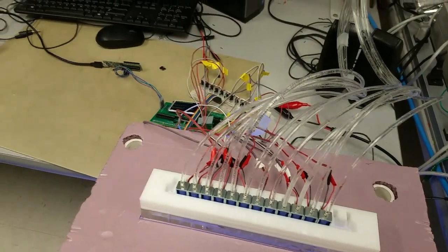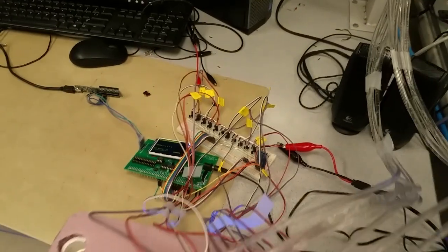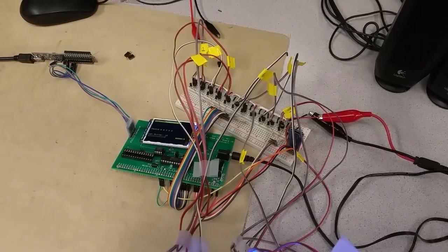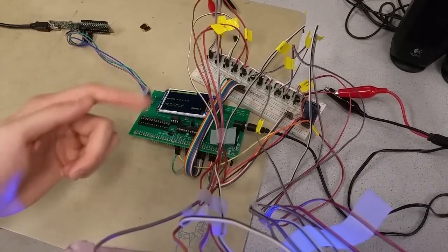So now let me talk about the app part. After the app is turned on, it takes five seconds for the computer to establish a Bluetooth connection with the HC06 Bluetooth module in the PIC32. There's a Bluetooth module right here. The rest of that board contains the solenoid drivers — the transistors, solenoid, and diode protection circuits — all connected to the signal line to the PIC32 GPIO.